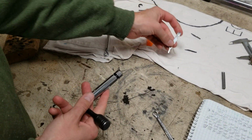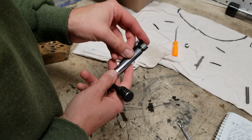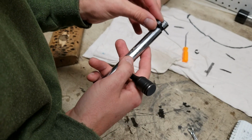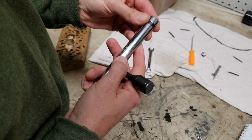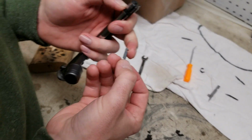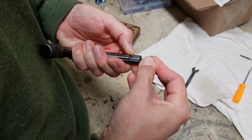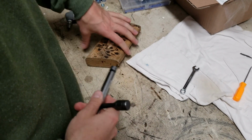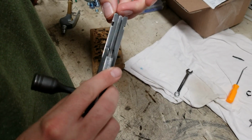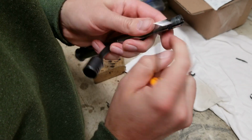Now, we're playing around with some different parts here. Typically, you put the firing pin in first, put your spring in, notches towards the rear. So it's easiest if you put that in first, and you take your extractor, sharp pointy one goes on the right, stick him in, slide him down. Make sure he's locked in there. There he is.